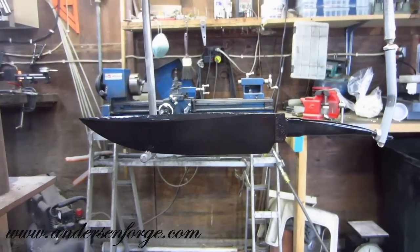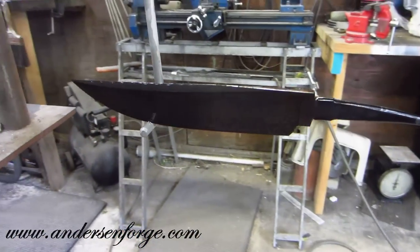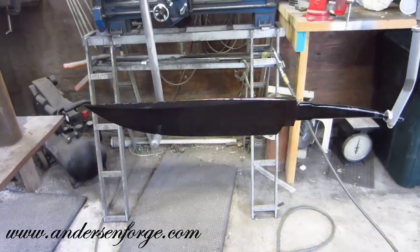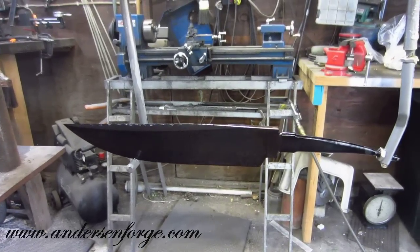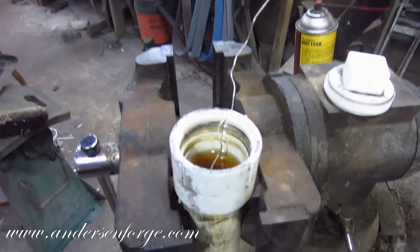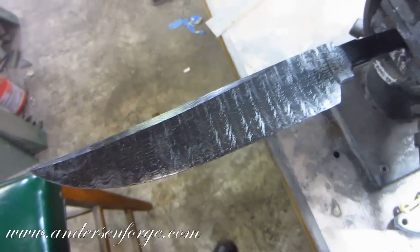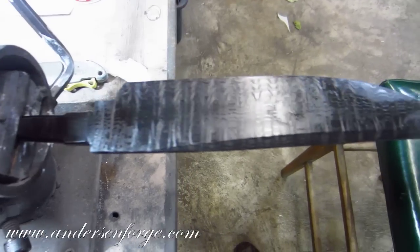Alright, we're back. You can see the blade now — there are some reflections, but the blade is now 100% black. It has been hot-blued, quenched in room-temperature water, and gone into boiling water to clean off any residual bluing salts. Now I'm going to take it off my gadget and suspend it in water-displacing oil for a little bit. You can see that blade is just black, black, black — completely black, a little wet with the water-displacing oil, but black in its entirety.